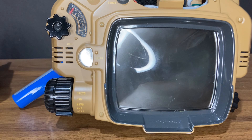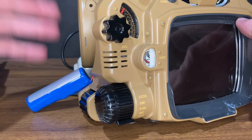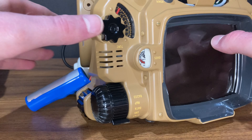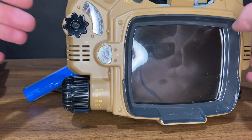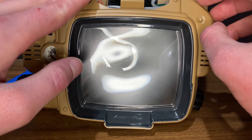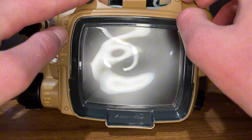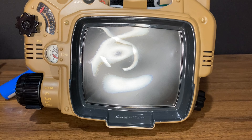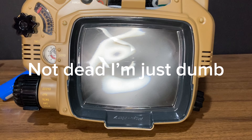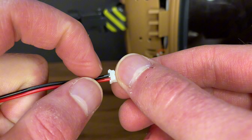We have a new backup and main battery installed in this thing. I'm really hoping that'll do something. The main battery is hanging out here just because I don't fully trust it — if it starts to smoke or something, I can easily take it out or turn this thing off. If I put it all back together it'd be really hard to get to it in an event of something bad happening. Moment of truth. Oh wait, the battery's dead — hold on. I did quite a bit of testing off camera and it turns out that it did matter that those two wires were switched. All I had to do was flip up the little tabs and change the position of the wires to reverse the polarity.